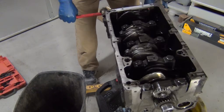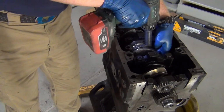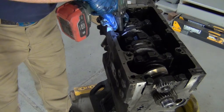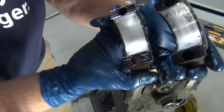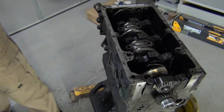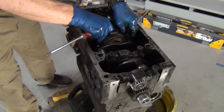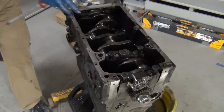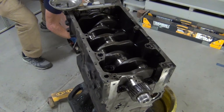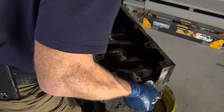It's so easy now — look at this. That spray is ridiculous, this stuff works so well. The bearings actually look pretty good. It's just the cylinders got rusted from sitting so long. Please keep the crankshaft from sliding either way. The main things needed were the sleeves and the piston rings. Don't use starting fluid — it's bad. It chews up the cylinders.